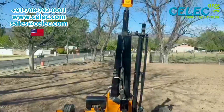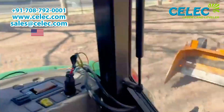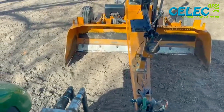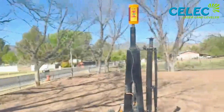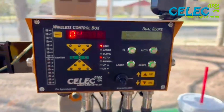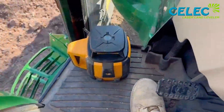I'm setting up to laser level this pasture. The first thing I do is set the scraper down to about where I want it. You can see I've got the link — the receiver is hooked up — and I'm in auto mode, but nothing else is lit up because I don't have my laser set up yet.